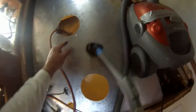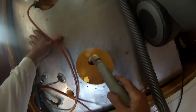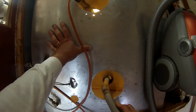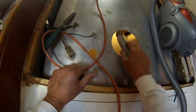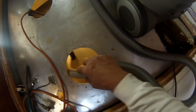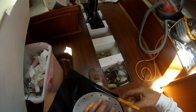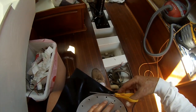But you know, you could have two primary fuel filter units that would make it easy to change fuel filters even if your tank clogged. And that might be easier to do than cutting holes in your fuel tank. But I think if you're headed offshore, with a good expectation of a three or four day gale down the road, it's peace of mind to know you have a clean tank and your filter system won't be overburdened.